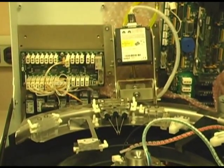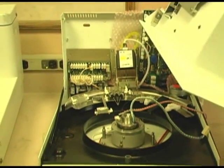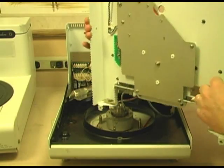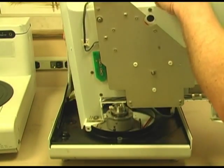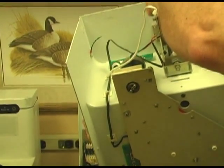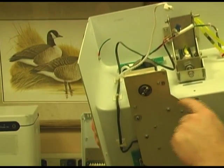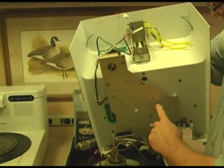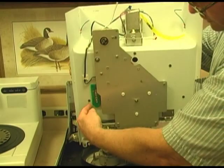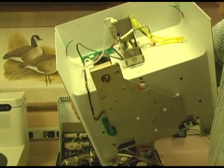On top of that you have the upper portion. This assembly goes right on top. Here's the injector — notice that it works off of air. This is what actually pushes the reagents onto the slides. This is the motor that turns — it's almost exactly like the bottom one — that rotates the reagents in a circle so that the proper reagent is dispensed. You have a detector right there, and a display keyboard type board right up there.